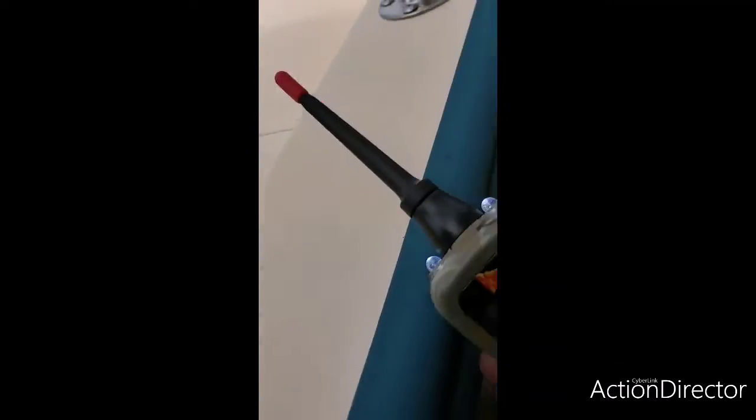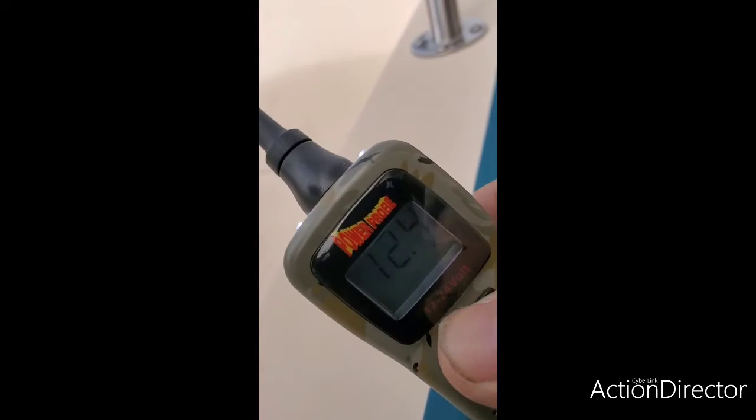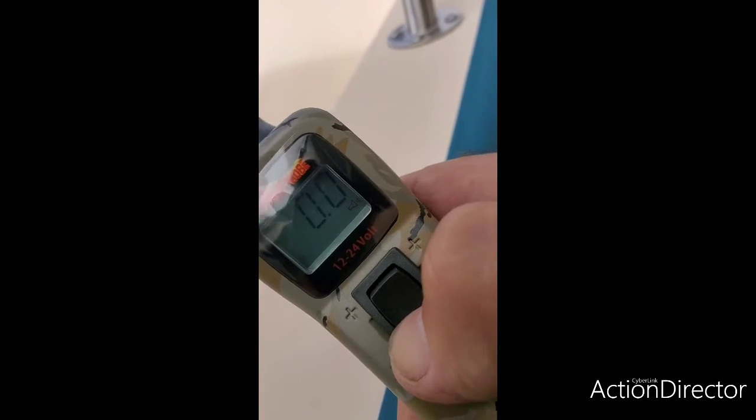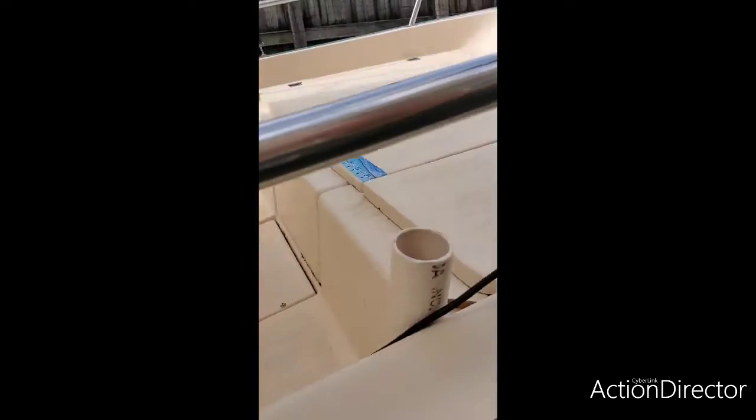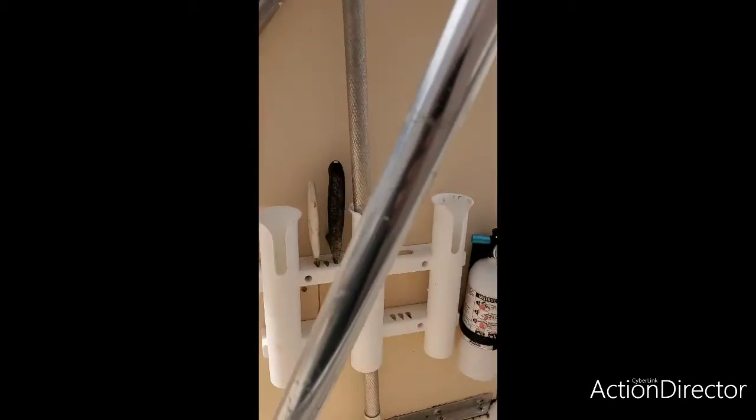Okay, when it is connected, you see the little horn there shows it's on. If you press up, it will apply 12 volts, and if you press down, it's for the ground. It could actually give a ground to the light. So you're not only able to test the circuit, you can see how it works. So right now I'm going to turn on the boat light. We're going to take a look at what the light does in the front. Okay, right now it's turned on. All right, so the light in the front of the boat should be lit,